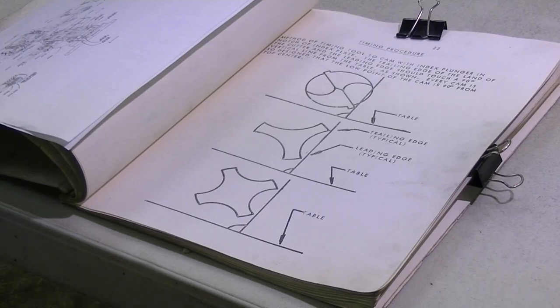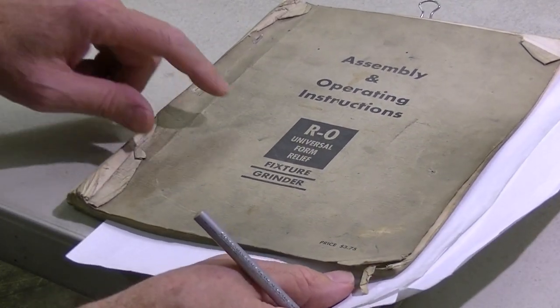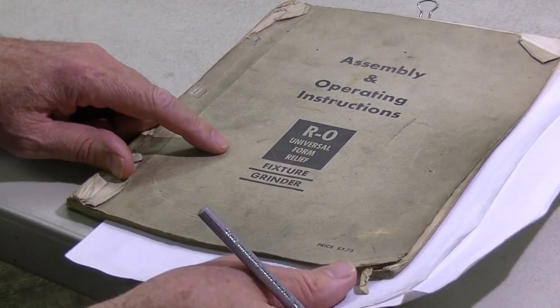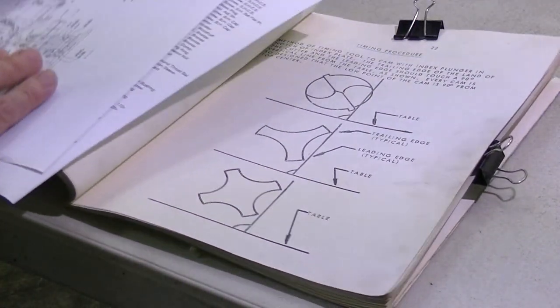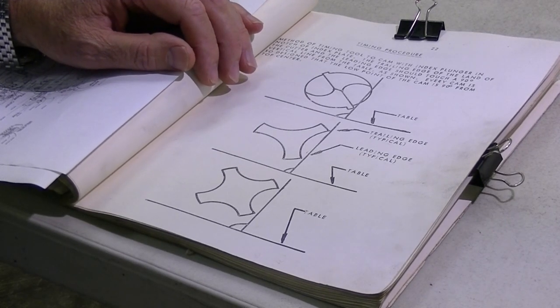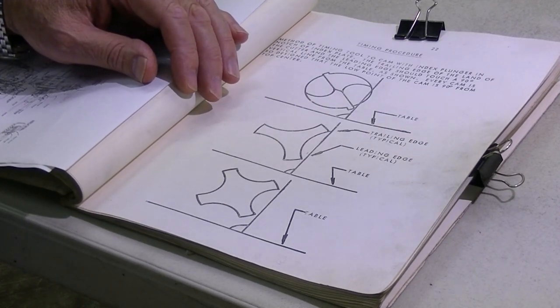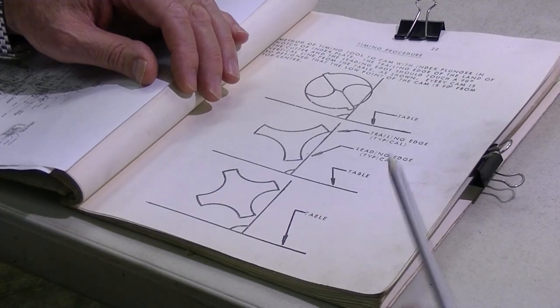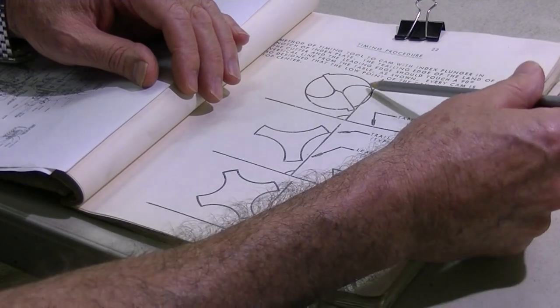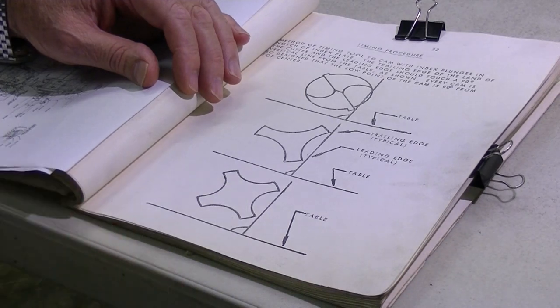Here we are back at the table. This is a manual I picked up for my Royal Oak universal form relief fixture grinder. We've seen that operating with countersinks before. One point of explanation is timing the cutting tool to the cams — there is a setting lug that drops into the cam plate setting groove, and you then align the tool to the collet so that the leading and trailing edge of the flute are perpendicular to the table, using a machinist's square.